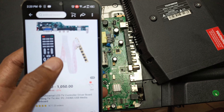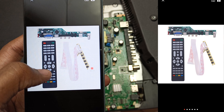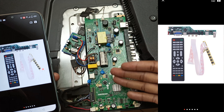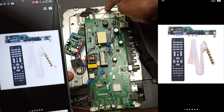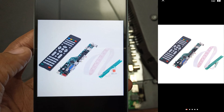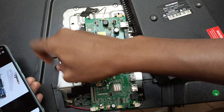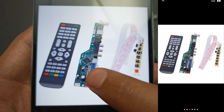When I first fixed this TV, I had my doubts about the original diodes that I replaced, and that's why I've gone with a much bigger full bridge rectifier. There is no way this one is getting a short circuit. It's powering time — this TV only has one button. It's not powering on.